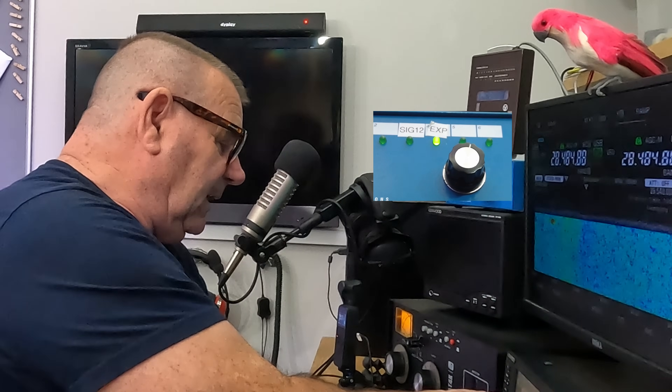The SWR has gone up and we haven't tuned the Game Master yet. If I come off his frequency I can hit the tune button — so that's tuned now. It's made no difference; still S-zero with the Game Master. Then the Signature 12.4 comes right up. We're just getting an idea of signal reports, not trying to work these stations.